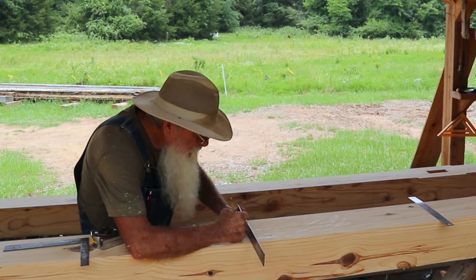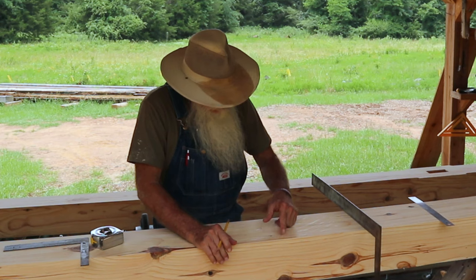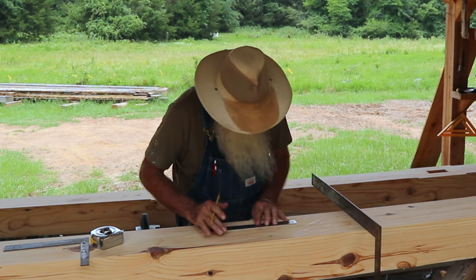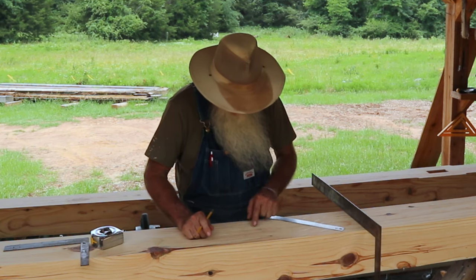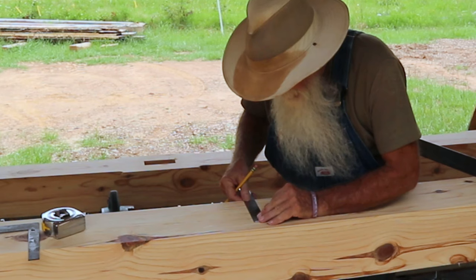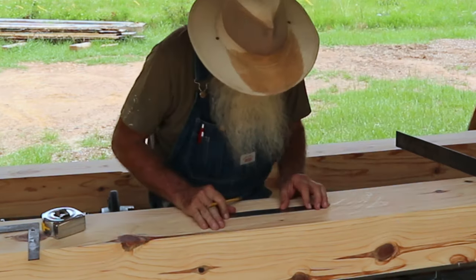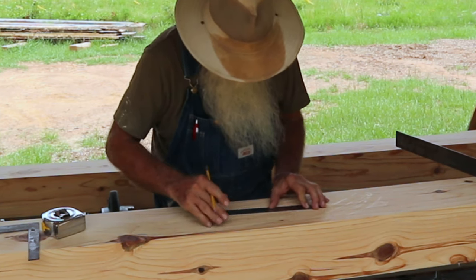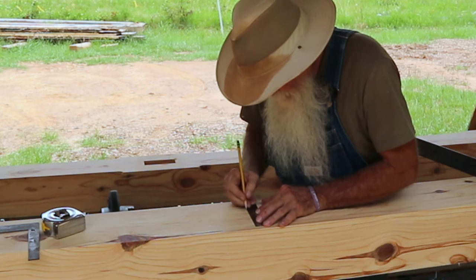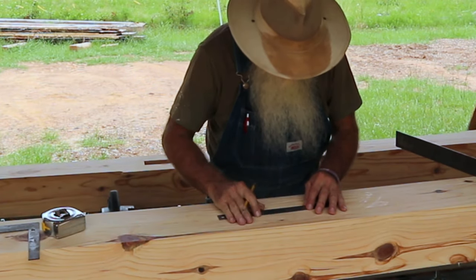I'll do that on both ends of it, and I'll have approximately the same amount of wood from the inside face to the edge of the post as on the outside. I'll draw a line on those points and score all four of these lines. I'm using an inch bit to drill down in there, so I'm going to come in from the outside — just under nine-sixteenths from this outside edge — and that will give me a guide to put the point of my drill bit. I'll keep the edge of the bit off the line and come back to that line with a chisel. I'll come in from the end the same amount, little under nine-sixteenths.